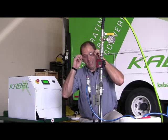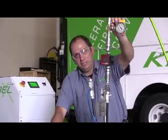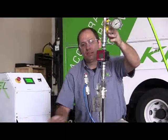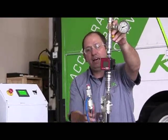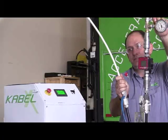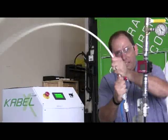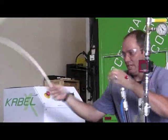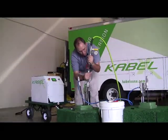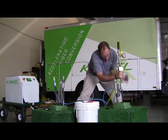Before I do that I'm going to put on my safety glasses. Now that I know it's not going to leak, I'm going to crack it open all the way and we're going to be ready to extract. This won't take long. There it is. As you can see, our core comes out quite easily and it's not messy at all. So with that I can actually switch now over to my other section for our ped-to-ped, and we'll extract that piece too.